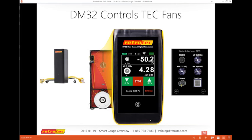Oops, I guess we have two of them. All right, so the speed control adapter is over there on the left, and you can see the devices that it controls on the right. This is one of the screens from the DM32. So it controls the Minneapolis duct blaster, the blower doors, different versions, but you do not need the speed control adapter to do the exhaust fan flow meter or the true flow grid. Those are just devices that just receive pressure. They're not actually controlled by a gauge. But those are also things that already have built-in control in the gauge itself. So if you want to use the exhaust fan flow meter or true flow grid, again, you do not need a speed control adapter to do that.